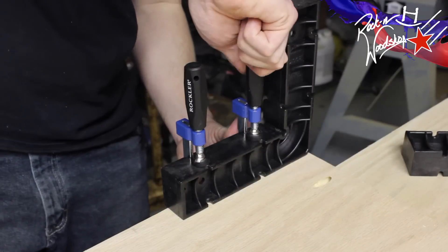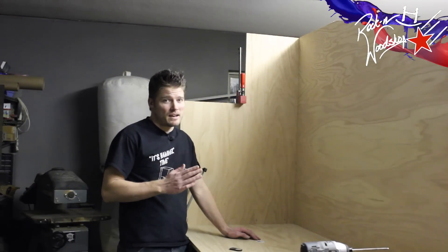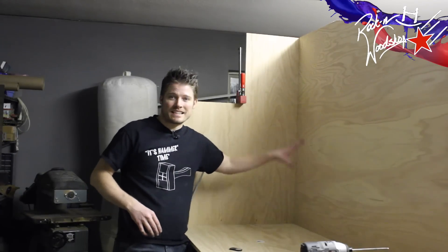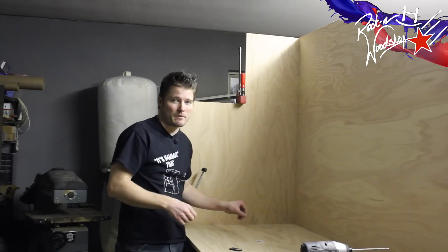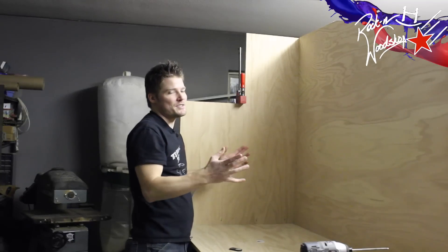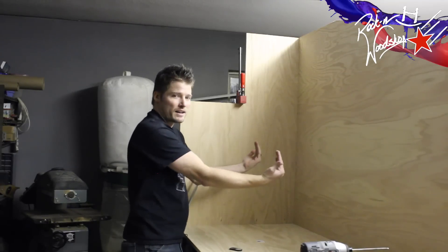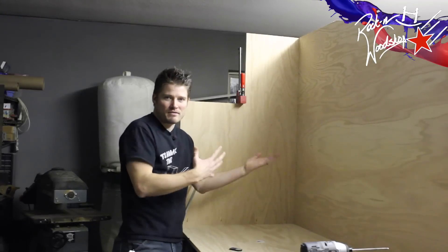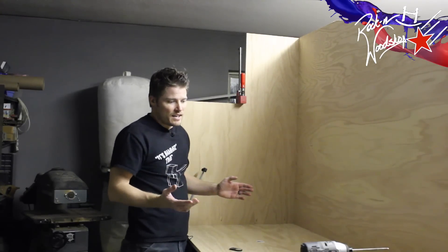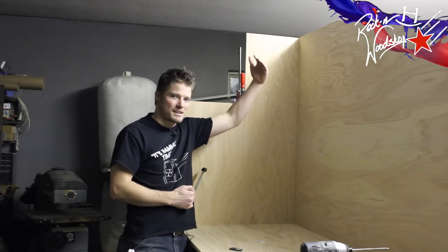I'm here to tell you, this upright is the hardest to put on. Now putting this thing together, you might have to think about a good battle plan. Originally I thought the pocket screws would go on the inside, but the problem is if I stood up the other upright, I wouldn't be able to get to the pocket screws all the way back there. So I had to rethink my strategy — I put the pocket holes on the outside and put that upright in. The other upright's pocket screws will be facing me so I can put them in. The shelves will all be facing the right way. The hardest part is going to be getting the face on, because I'll have about 15 inches between the face and this upper upright, so getting my drill in there might be a little difficult.